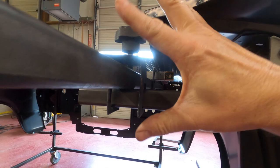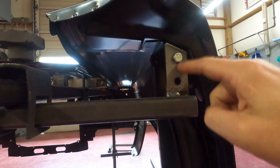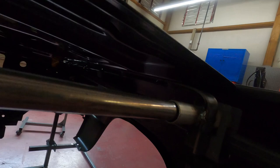That saved me from having to engineer something already on the market. The square tube just goes through the knuckle; there's a set screw on a knob that adjusts and pinches, and your square tubing gets held there. I handmade all of the stuff that mounts to my specific panels, including my hinges on the back — a super simple device: square tube into a piece of round conduit, a larger piece of round conduit, a piece of flat plate, bolted into my hinge location. Super simple, and I've got a functional hinge.